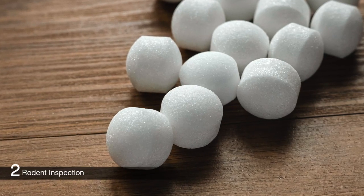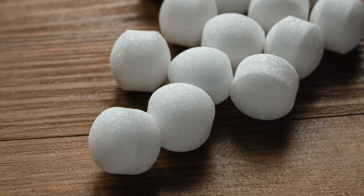If you've used naphthalene moth balls to deter rodents, remove them from the heater before attempting to ignite it, as they are highly flammable. Even if they don't ignite, they can release toxic vapors when heated. Clean out any rodent remnants like nesting material or droppings to avoid foul smells or a combustion issue.